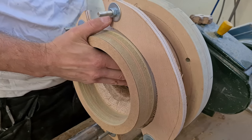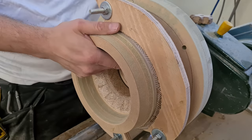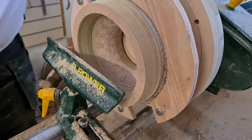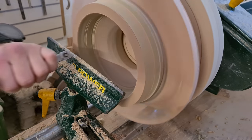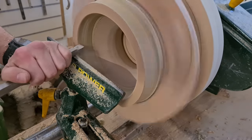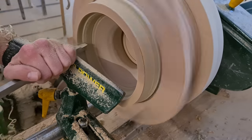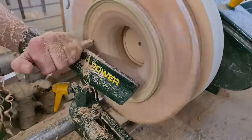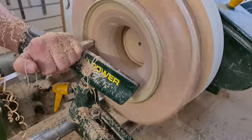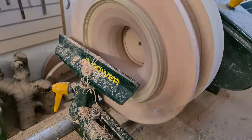I fitted the outer braces, and you'll probably be noticing that the bolts are facing the business end of the woodturning, which introduces a moving metal part quite close to the hands. So I personally wouldn't risk them, and I did actually reverse them into a better direction before proceeding. I used the bracing to finish the inner aperture of the torus so that the retainer block would fit neatly into position, and then give me the room to finish the outer sections once the bracing had been removed.